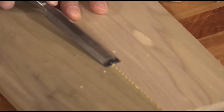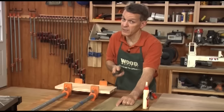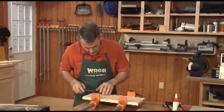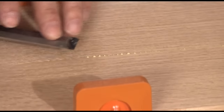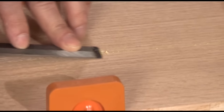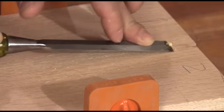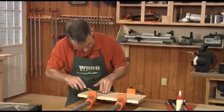Not only does it get hard, but if you try to take it off at this stage it can peel up little wood fibers, because again the glue is stronger than the wood. So it's better to come back to your glue up at this point. You can see those little beads — they're just getting to be kind of jelly-like. You can press on them and they feel a bit like pudding. Bring a chisel along and just gently scrape those off. Get rid of them before they turn into those hard beads later on. About 20 minutes is what you want to wait until you see those little beads appear.